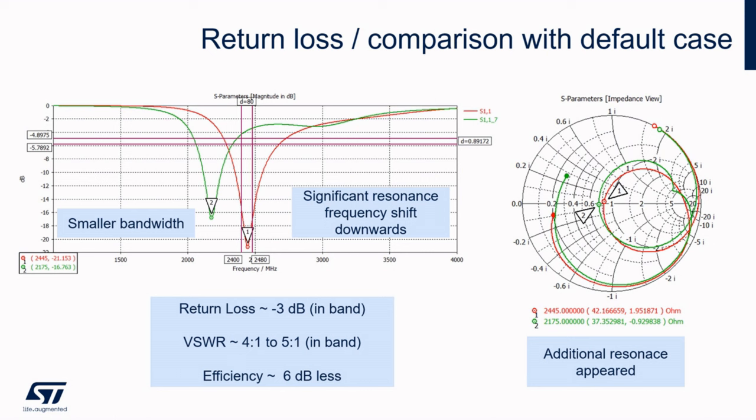What is unusual is that a weak resonance appeared near the desired band. Of course it depends on the distance from human tissue. This needs to be evaluated because such a secondary resonance can be only present near human tissue and can completely disrupt the matched state of the antenna. When looking at the VSWR, we can see the tuning of the fundamental resonance, but also the secondary resonance located close to the band, and resonances at higher harmonic frequencies as well. Further, efficiency drops significantly. Some part of the efficiency loss comes from mismatch, but even if you manage to get the antenna to the right resonance frequency, you still won't get good efficiency — you simply burn a lot of energy thanks to the human body.